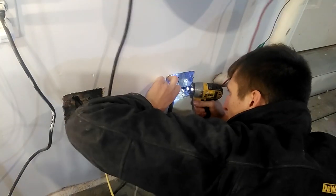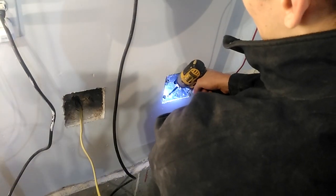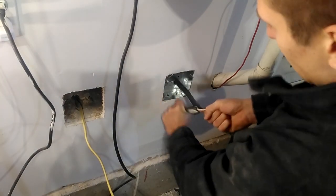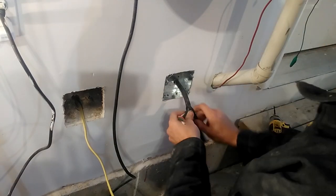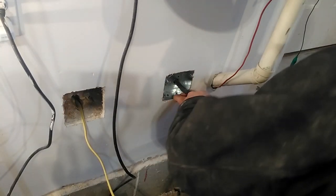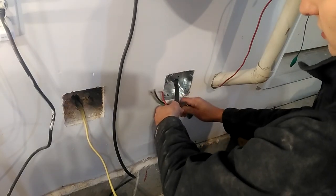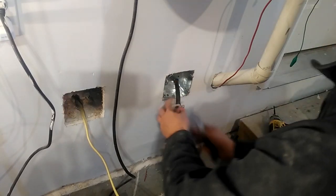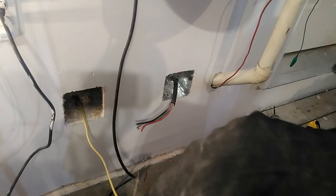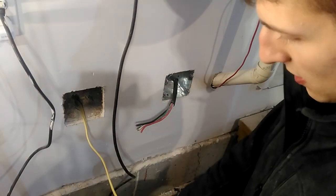Put in a few screws — there was a bottom plate plus a stud, so I could go in on the vertical and horizontal with a couple of three-inch screws. Then I finished ripping the casing off the cable. Once you get it back far enough, take your knife and cut off the excess casing, but make sure you don't come anywhere near cutting those wires. If you nick one, you'd have to cut it all the way back and start again. Next, grab your wire strippers and strip off the ends of those wires.